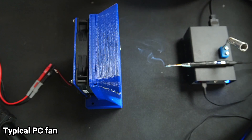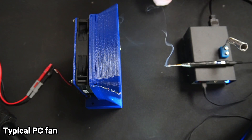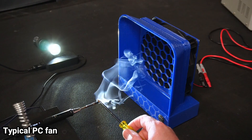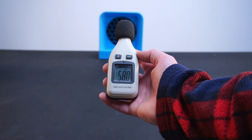Ultimately, the bottom line was the fan had to be moved at least 150mm or closer to be what I'd consider effective. Clearly, the Noctua industrial fan was the best option for the job. And it's not like you're compromising much for the performance, coming in at 58 decibels.